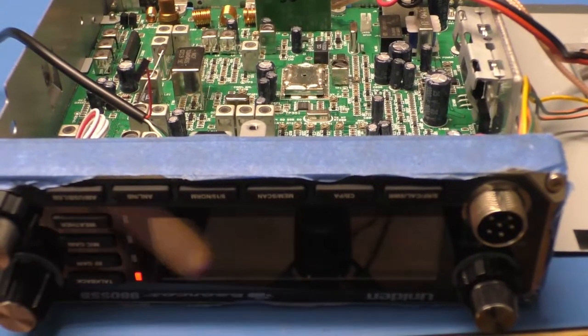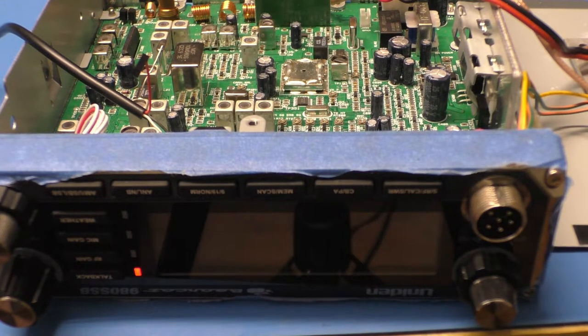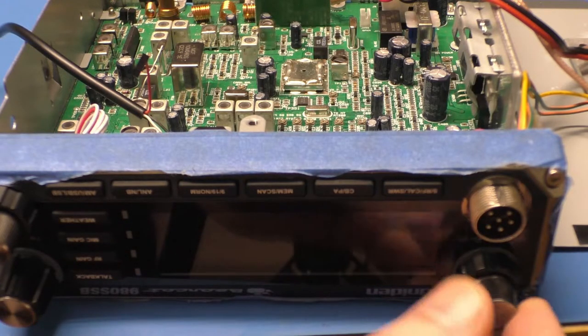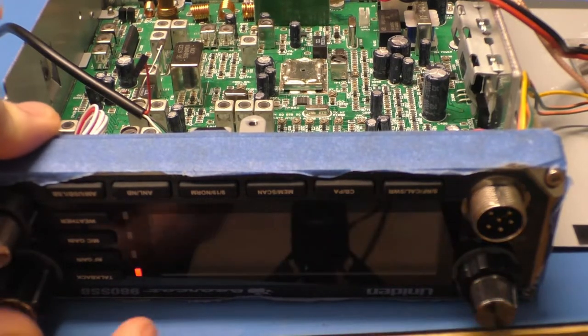There's not going to be any indication on the radio that it's happening, and that light will go out and the radio should boot up. As soon as it's done — it went out, but the radio didn't come on. I turn it off, turn it on — nothing, dead. But I can go back into this. It's basically soft bricked. Why did that happen? It happened because of this cheap prolific knockoff. That's why.